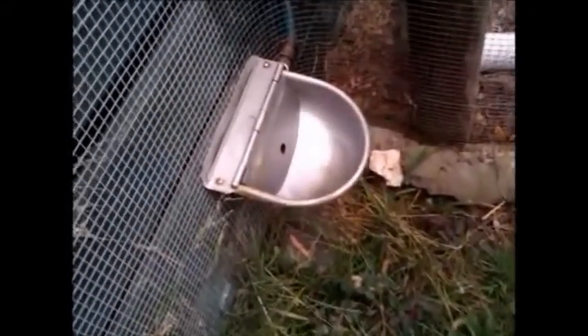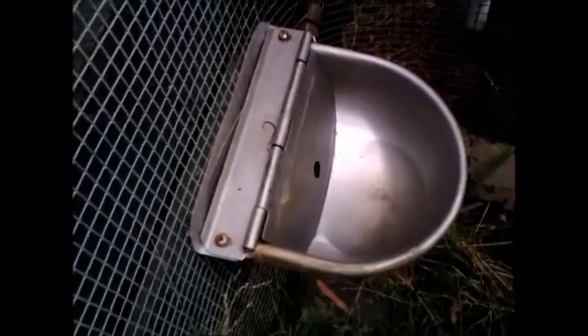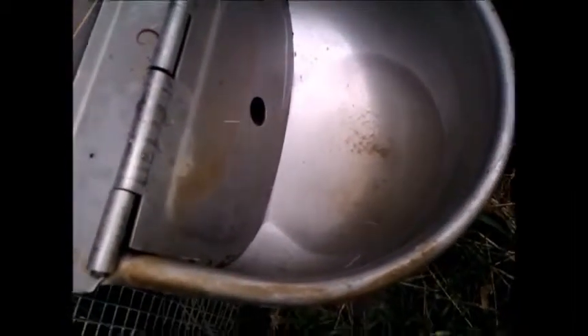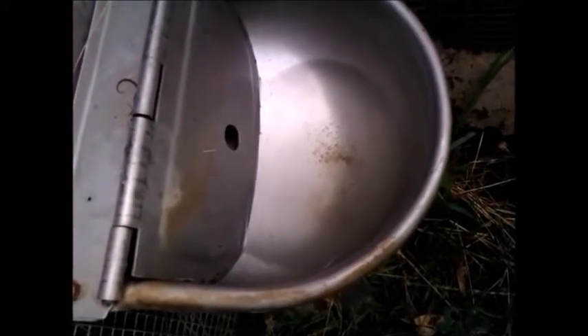That's because the height of the opening is quite high. So this water is not filling up from the rainwater tank quickly - it's slowly filling up. It is gravity feeding - it is less pressure than the mains, that's why it's filling up very slowly.